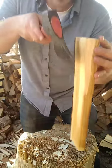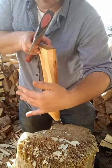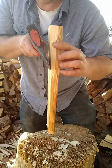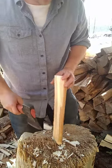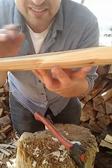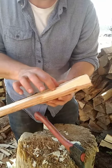Here's a piece of wood that is thinner because when the axe came down, the log was over on this side so the axe tends to make the split run out — it gets narrower on the outside as it pops off. This is actually fine; I just want to point it out. The main thing is I would orient the spoon bowl over on this side of things.